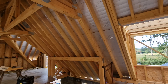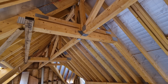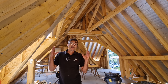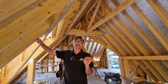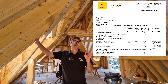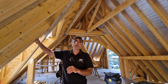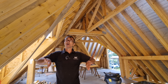You can just imagine how effective that insulation is — as I said, it's like a flask. The whole outside of the roof is already completely covered really well, all the ridges meet beautifully, all mitered in. We know for a fact we've done a really good job already — that's the basis of our warm pitch roof construction. As I said at the beginning, there are so many ways of achieving it, so many materials and applications. It all boils down to following a system. It is time consuming, but the payback is a far far better insulated building and much more efficiency out of the building.